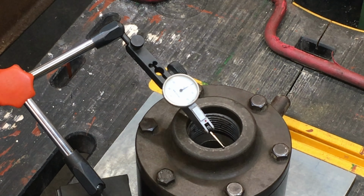As the backplate came off, rust, swarf and old oil dispatched an odour that would have knocked a dung beetle off its feet. Despite that, the joint faces looked okay, but I wasn't going to take any chances. By using the flattest stones I had, I cleaned off the trace marks that I had made separating the two parts and some marks that I hadn't expected to see.